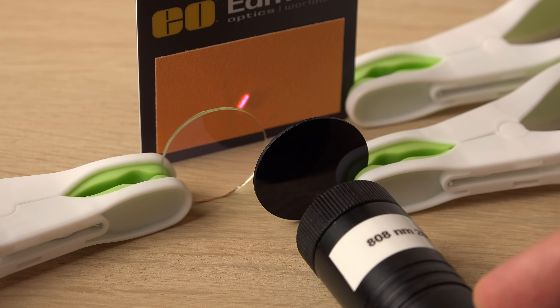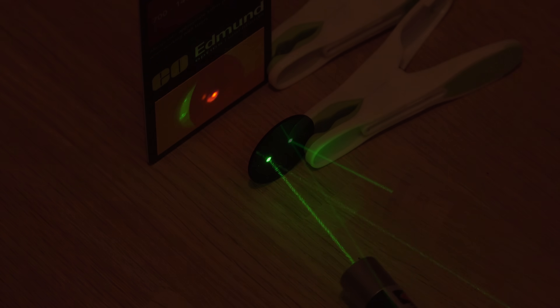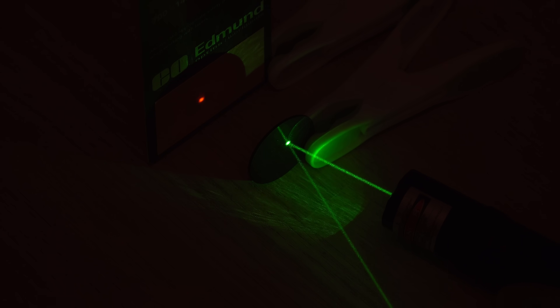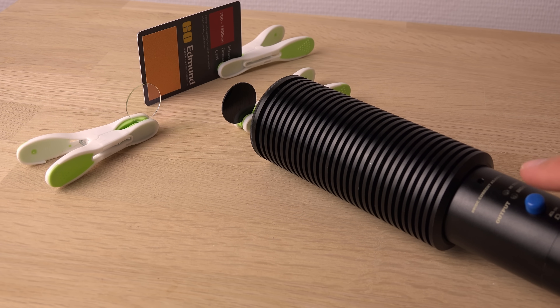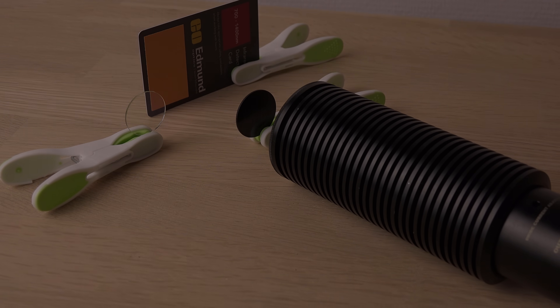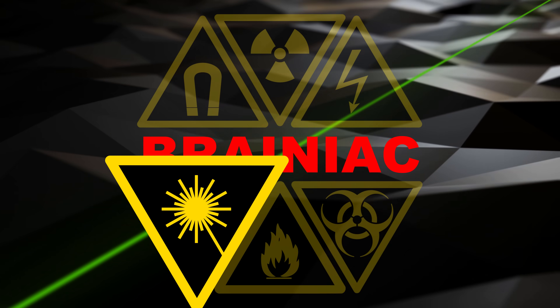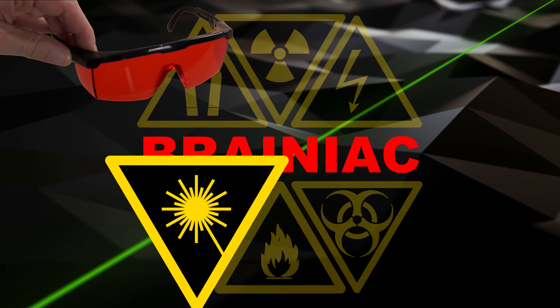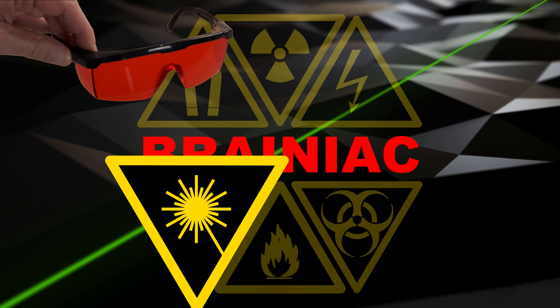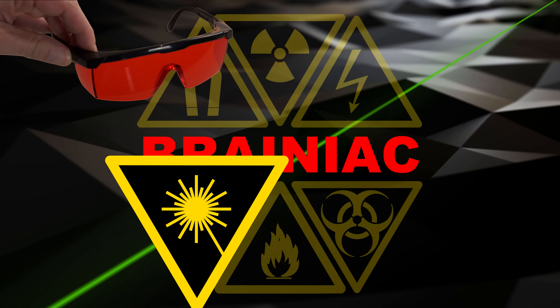To save costs, an important component to filter out invisible infrared laser radiation may be missing in your laser. I will test my green lasers for this and even test if the mighty Hercules has this issue. Powerful lasers will damage your eyes — always use laser safety glasses, especially when using reflective glass in front of them and invisible lasers as I do in this video.